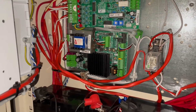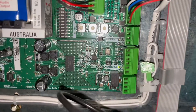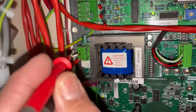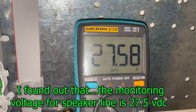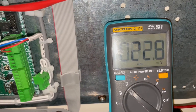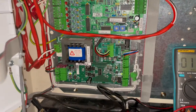I got an amplifier from one of my other buildings to compare. Let's check it — there are no problem or defect LEDs blinking, everything is normal. Checking the output voltage of this good amplifier with the 10k end-of-line resistor: the voltage is 27.5 volts DC. The faulty amplifier only shows 10 volts DC, so we're 100% sure the amplifier from the first job needs replacement.